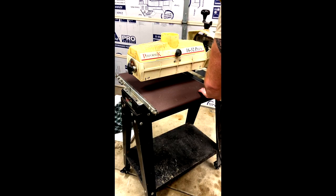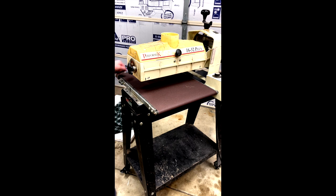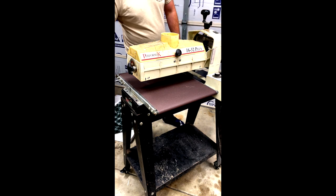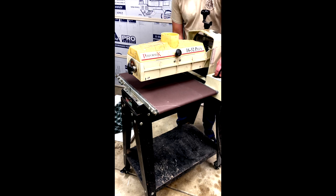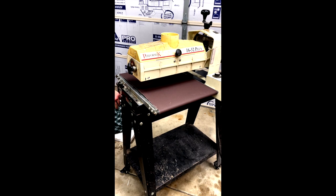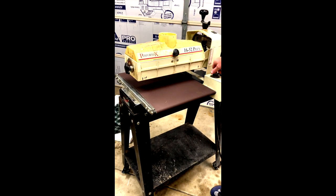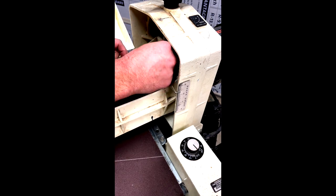Here I am marking the table for the conveyor, trying to figure out which way the conveyor is moving — if it's drifting to one side, I'm going to lengthen the table on that side and shorten it on the other. Making small adjustments is the way to go here. Also, pay attention to not over-tightening the belt, as that will lead to it deteriorating and pulling apart faster. Once you have everything set, just see if you can stop it from rotating — if it stops, it's too loose, and if you hear grinding and clicking, it's probably too tight.